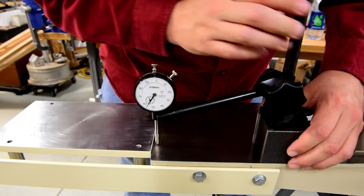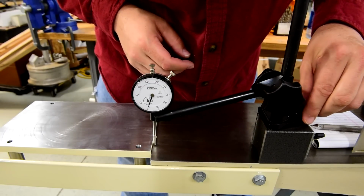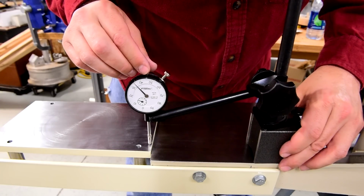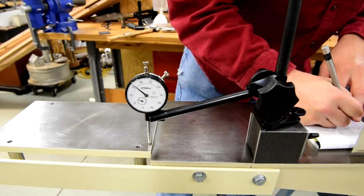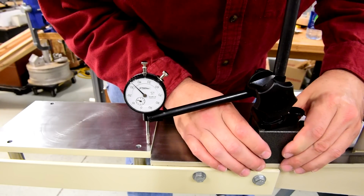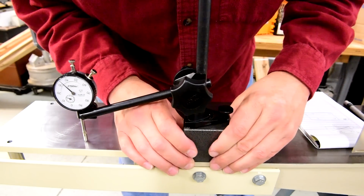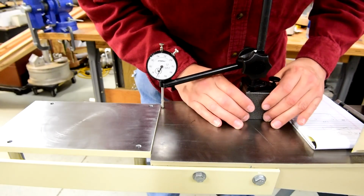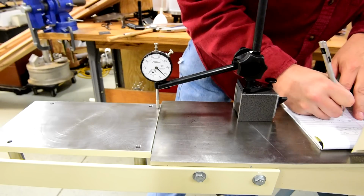I made the spacers extra long so that I could then measure how much height I need to remove from each one. This will minimize the amount of shims I will need to use. Also, the horizontal brackets are not exactly lined up, so independently adjusting the height of each spacer will make up for that imperfection.